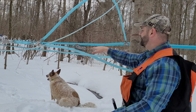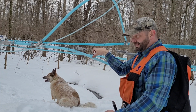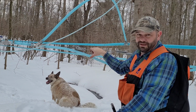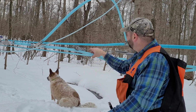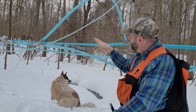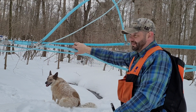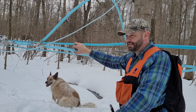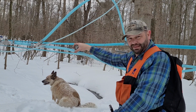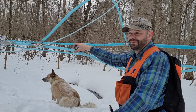This is how we set up woods today. You saw some of the old sections that we tap. That tubing's 15 years old. It needs replaced. This is the modern, I call it the Emmerich way. But this is, anybody who wants to make a half a gallon of syrup for a tap, this is the way you do it. Wet, dry, with a whip, and then 3 to 5 taps per lateral. Put in more main lines. Spend the extra money, and then you bring your laterals off one side of the main line.